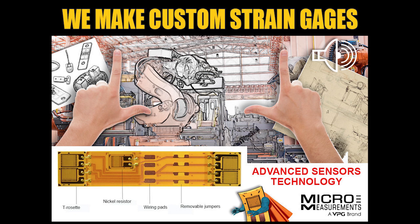In this application it really fits because this thing's going to be battery powered, so power consumption is a real big concern. We're going to boost that resistance up in order to reduce that current draw, and right now we're looking at using a 10,000 ohm strain gauge.